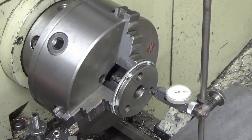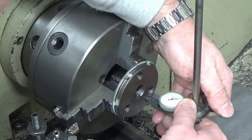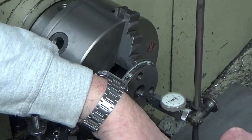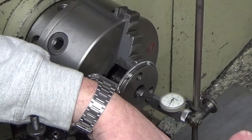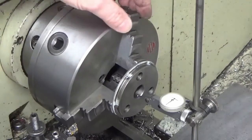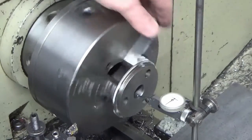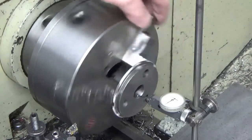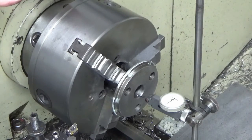So same idea, got my favourite clock stand that I keep going on about and I keep using, just to show you again how easy this is. Just drop that in there, wind on, find the lowest point, set 0, that easy, no droop, no sag, nice and simple. And in that crappy surface finish it's reading just under 2 divisions, so that's within a thou. It's 5/10 per division on that clock, so I'm going to take it that's good enough.